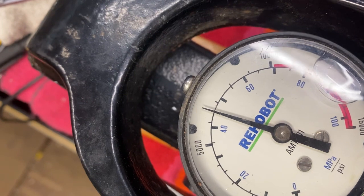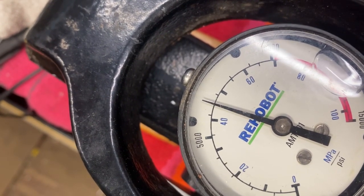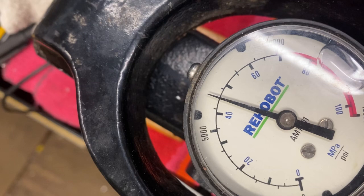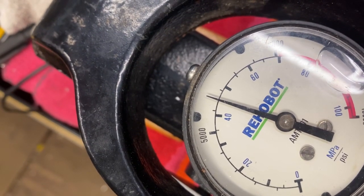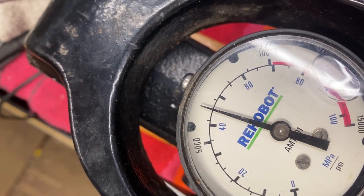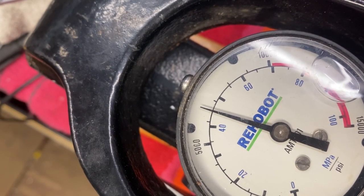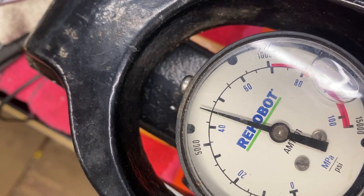Because in any case, 450 it shouldn't yield. Of course, the part where the surface is over the yield strength, there could be microfractures developing, could be, but anyways, I'm not going to use these 2 cylinders after this test.